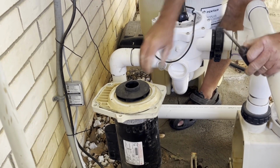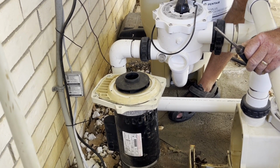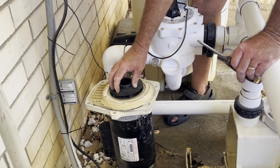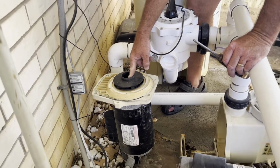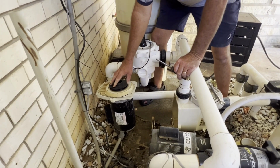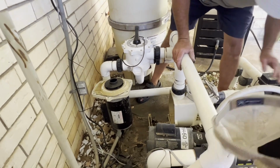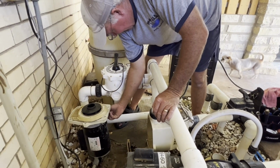And what that does is it prevents the impeller from coming off. If you have a big buildup of air inside the tank, you turn the pump off, this air is going to force the water backwards through the motor, and it'll spin that impeller off. Hayward does this all the time. So Hayward pumps are notorious for spinning the impeller off because they don't have a set screw in them. This would be the older ones. The Super 2 model is really bad, and the Hayward North Star, it didn't have a screw, also really bad. But the newer pumps do have them, so I'm not trying to give them a bad rap. I just have a lot of bad memories of those pumps coming apart.